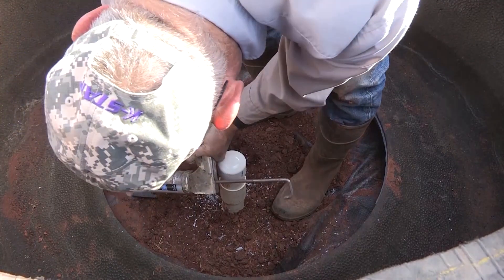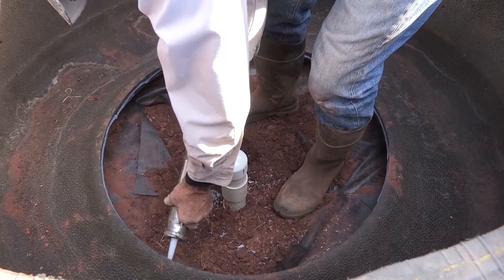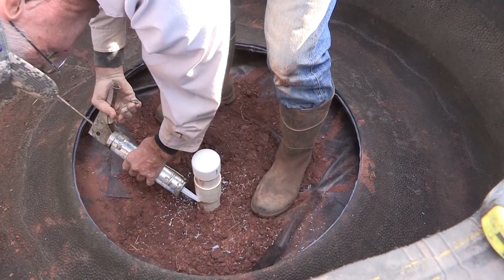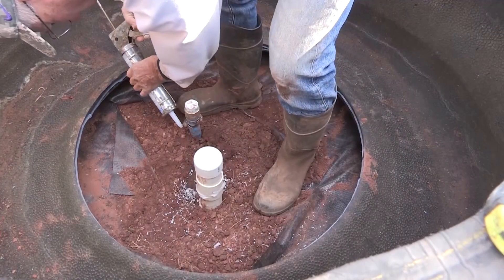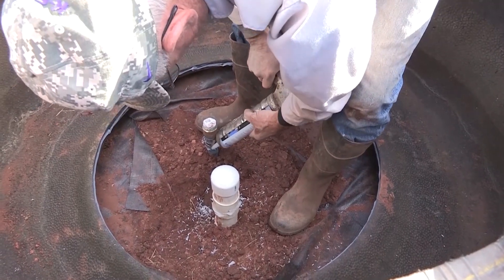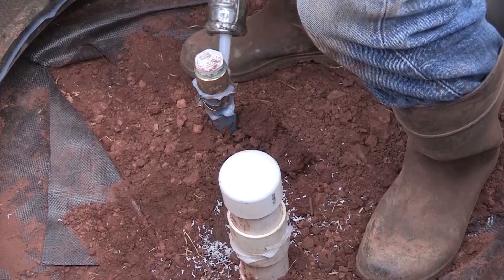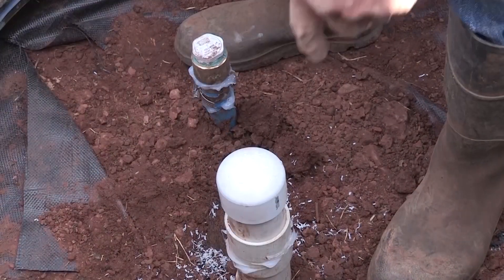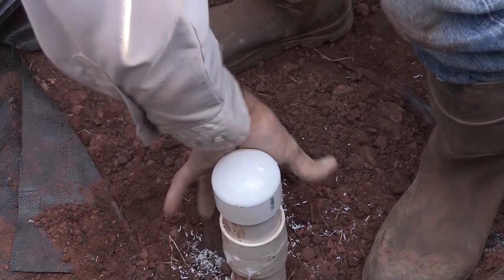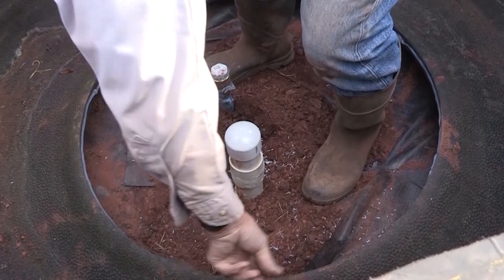Then use a finger and smear it. The silicone adheres pretty nicely and the concrete will just smash right into the fresh silicone. We also put silicone around each of the pipes — down here, and also up here on the top. I sometimes just get it gooped on there because I'm going to use my finger. As much as I don't like to, you wear silicone for a week — you just want a seal all the way around those.